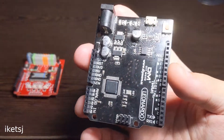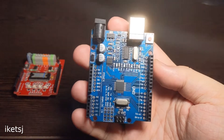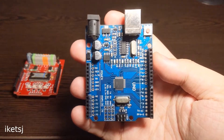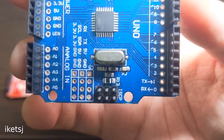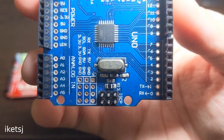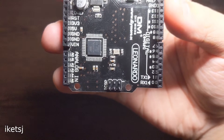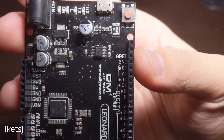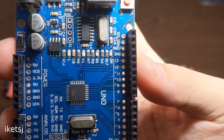You may be wondering — why would I use a Leonardo board instead of the typical UNO board? This is because an SPI pin of a UNO board is in conflict with this particular motor shield. The SPI pins of a UNO board are connected to pins 13, 12, and 11, as opposed to the SPI pin header of a Leonardo board, which is independent from pins 13, 12, and 11. Pin 11 is the one in conflict with a UNO board.